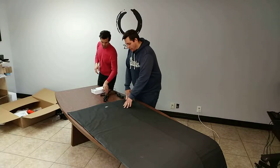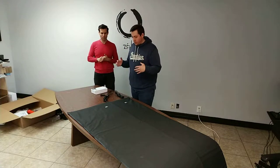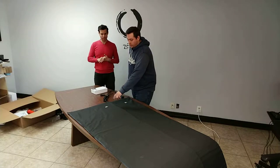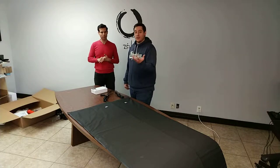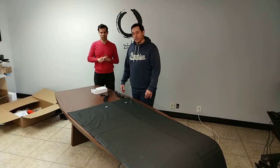Okay, so these are your two heating pads. The first thing you want to do when you're setting up your heating system is make sure that the 'this side up' sticker or patch is always up. If you see one and you don't see the other, there's a good chance that one is upside down — the heat radiates up. So if you've got your pad upside down, it's gonna radiate into the floor and you're not gonna get the heat that you need.